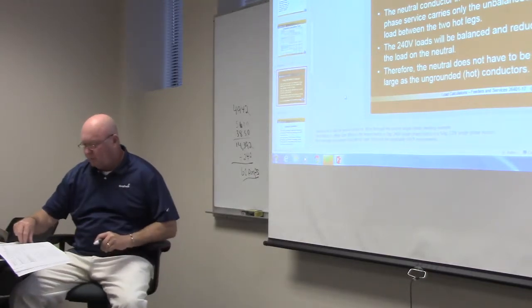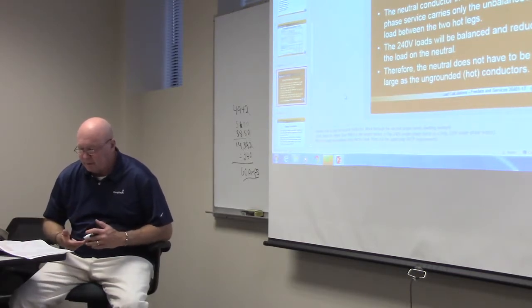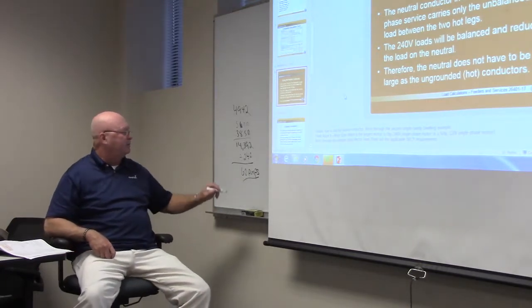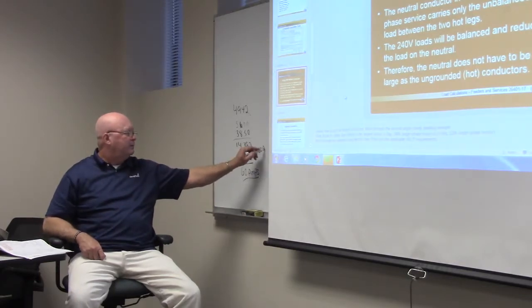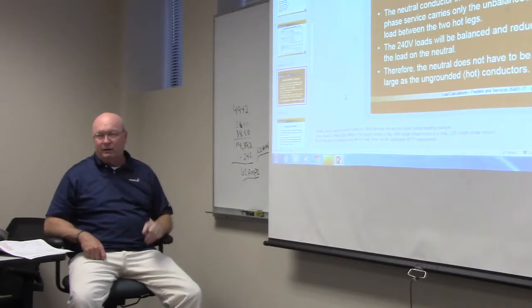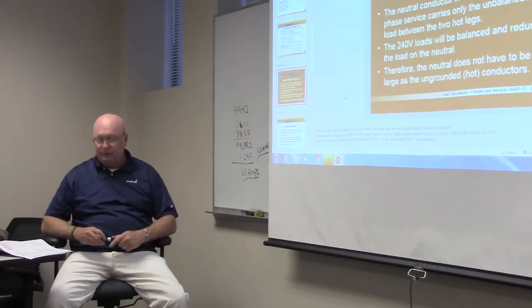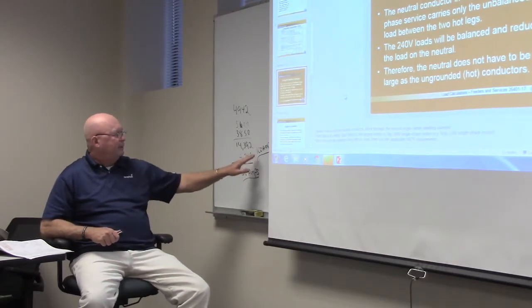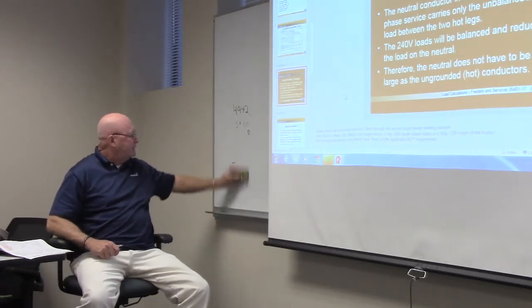Okay, all right. But if we turn over on page, just keep going on page 20. So the service entrance conductors have now been calculated and must be rated. We know that you can't do it at 60 amps, right? The minimum size service you can do for this house then would be what? 100 amps by what it says here, 100 amps. But odds are you're probably going to actually do it at 200 amps on a house, because Duke Energy will only put a 200 amp meter up. So, but legally speaking, the next size up would be 100 amps if we got a 60 amp load.